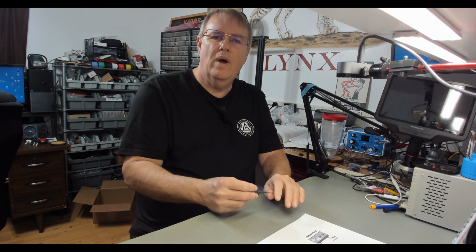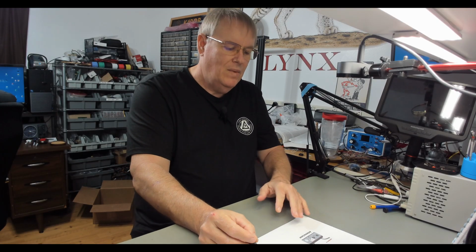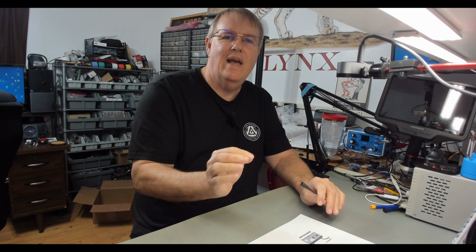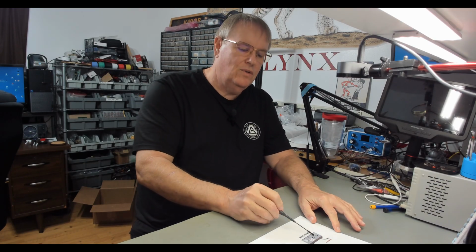I want you to come away with, you don't lose all the energy that gets reflected, but you do want to have the best match on your antenna you can. And we know you want to have a good match with your radio. Our little example showed that we gained a little power when we matched, and we don't have very much SWR to deal with. And just changing with an antenna tuner that little bit, the energy changed.